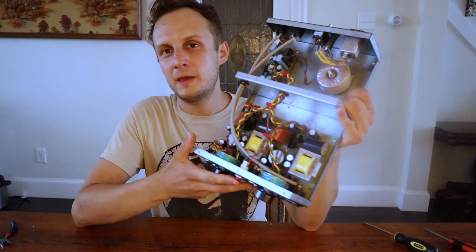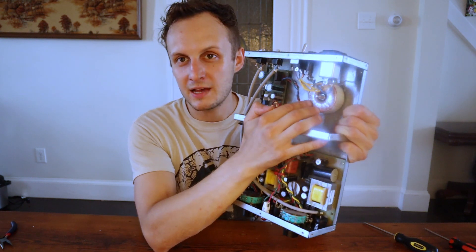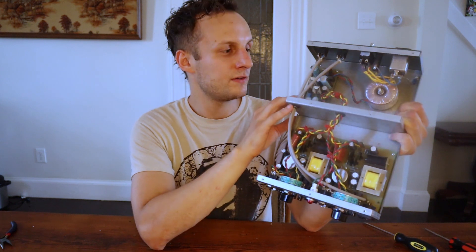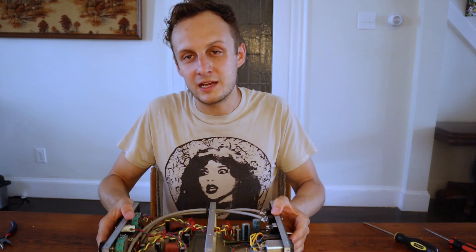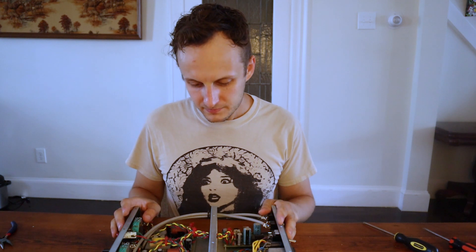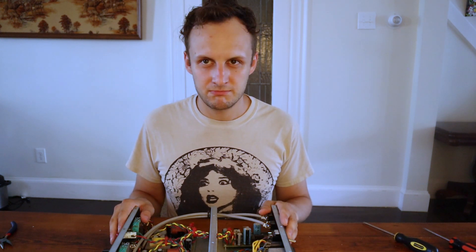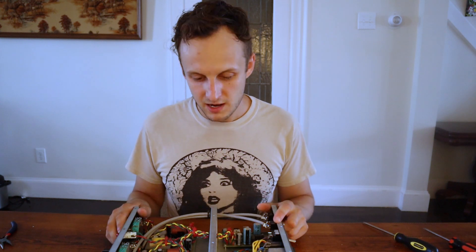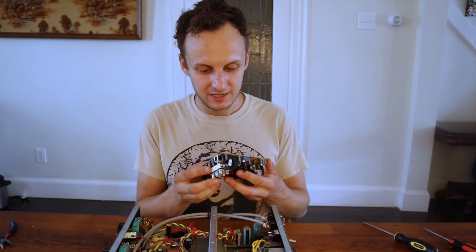The Hamptone's power supply is just textbook — it's the way you want to do it. You bring power in directly from the wall, a transformer steps it down to close to the voltage you finally want, then discrete regulators step it down precisely to that voltage, and you clean it up with filtering. By the time it hits the actual audio section, you have your ideal voltages — it's all quiet and clean. That means lower noise floor and better headroom. This power input jack is maybe five bucks, the transformer maybe twenty — probably another fifty dollars on the power supply all told, which Behringer just skips entirely.